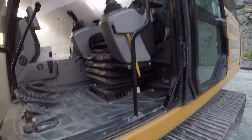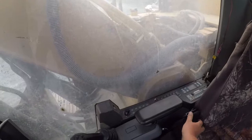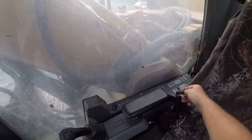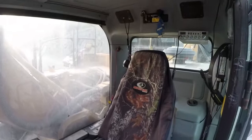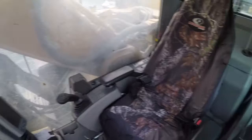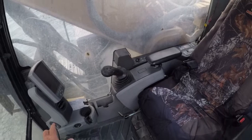We also have a seat belt — make sure there are no torn or worn parts, no frays, no grease, and connections are good. We have a monitor and our hour meter. Primarily we have our pre-shift: if we find any safety items or issues, note them. We can adjust your seat function. We're going to get in here and start this up.